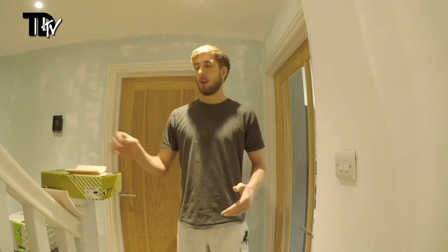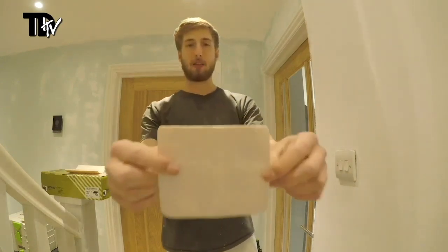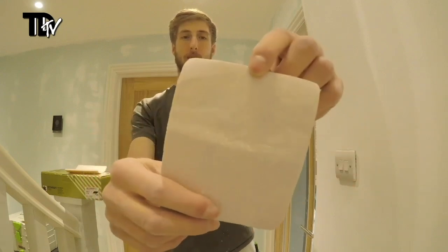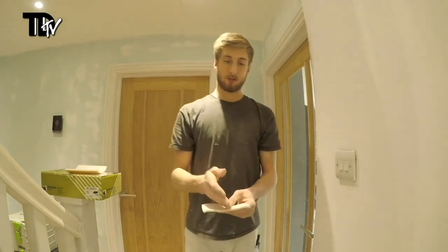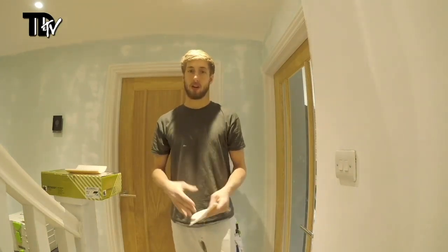The second thing I really like about these pads is that the grip lasts a very long time. Unlike traditional sanding pads where the grit just falls off onto the floor, leaving you with areas that are completely useless — with these, they do wear down as you use them, but this pad here I've been using for pretty much this entire hallway. The grit has become finer but it hasn't come off, so it stays on and remains usable for a long time.